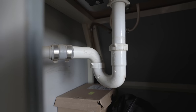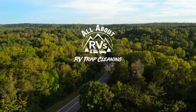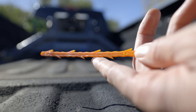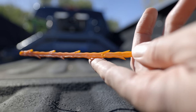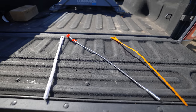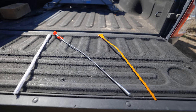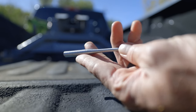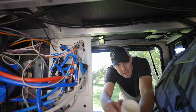You want to be careful because you don't want to damage something on your RV, so you want to use the right tool. We have things like this where you can stick it down the drain. If you have a P-trap, the barbs on here will catch the hair and help pull out whatever might be plugging the sink, the shower, or that drain. But if you have a HEPVO trap inside of your RV, then something like this can damage that.